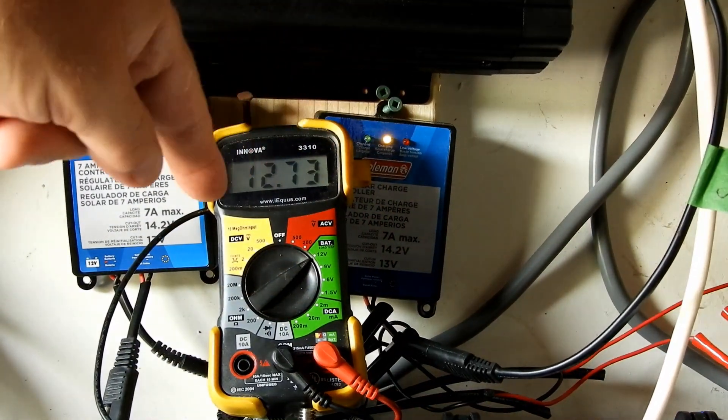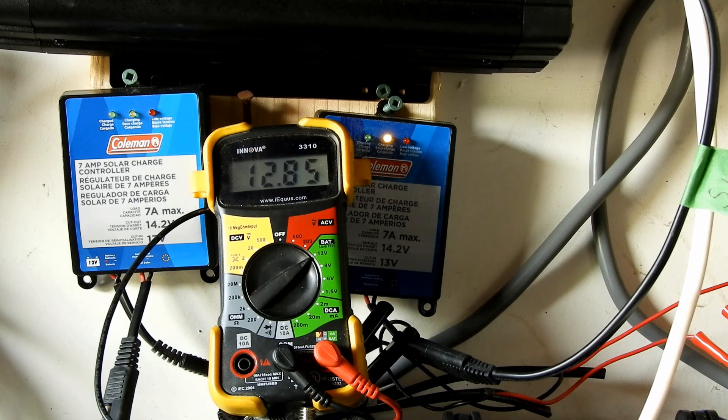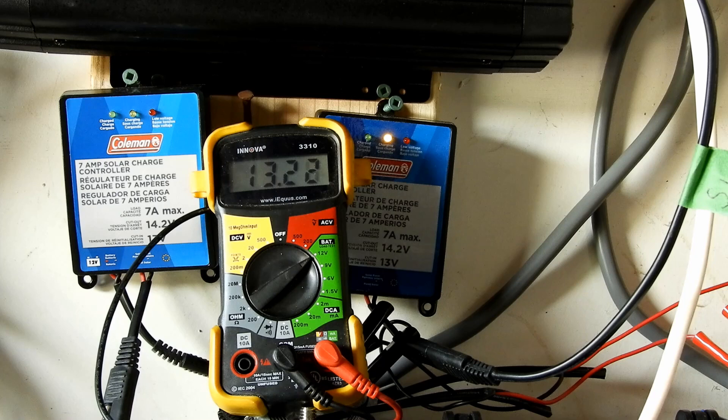This is the charge controller. The yellow light just went on, so it means it's charging, and we'll just watch the voltage climb up. One of the concerns was that when my panel's charging my battery, it'll go up as high as 15 volts on this display, and that's going to hurt my battery. Well, no — it's not going to hurt your battery. In order to charge a 12 volt battery, which will sit at around 12.75 to 13.25 fully charged, you have to exceed the battery's voltage. Otherwise it will not be able to push any power into the battery. It has to be a higher voltage going into a lower, so it's perfectly normal for it to climb up to 15, 15.5, maybe even 16 volts. It just simply has to do that, so it's not hurting the battery.